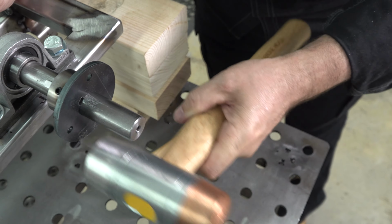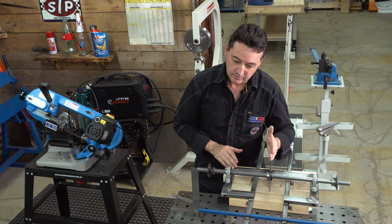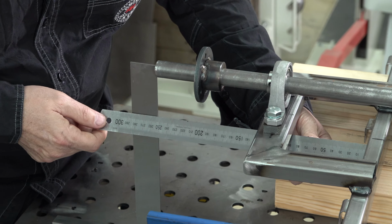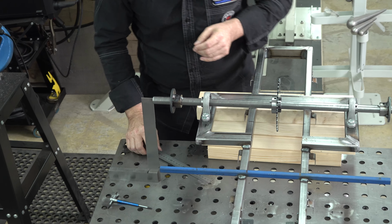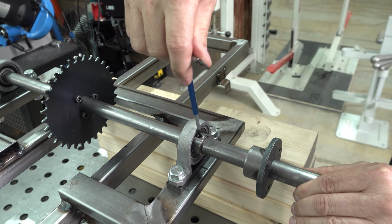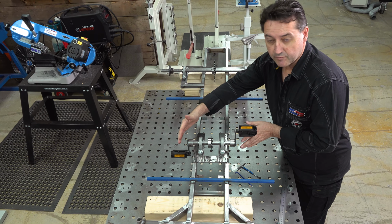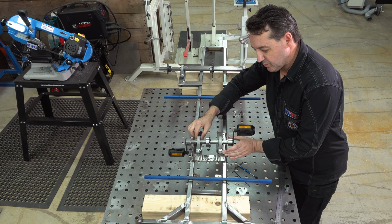We've set up our outside hubs. Now what we need to do is centralise the rear axle to the chassis. We measure from the outside vertical face 253mm to the end of the axle, right here. Then what we can do is we lock our grub screw on the bearing, make sure they're the same both sides, 248mm.